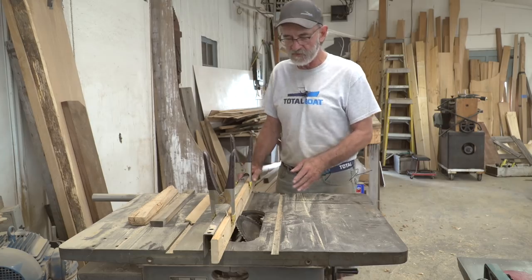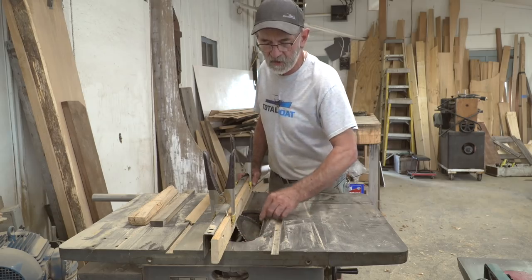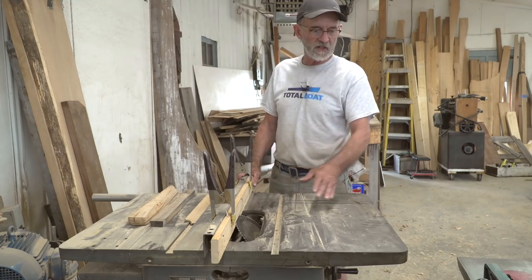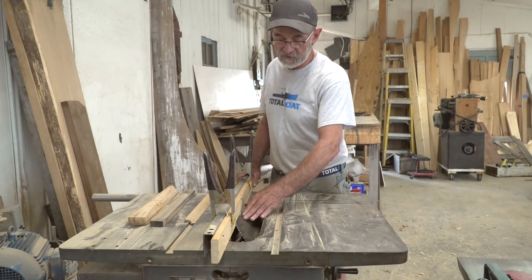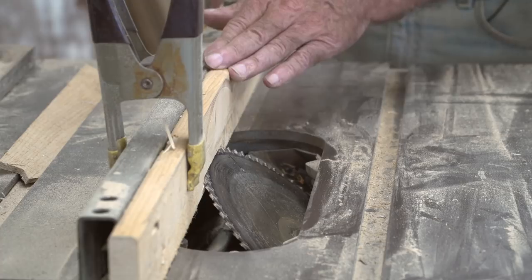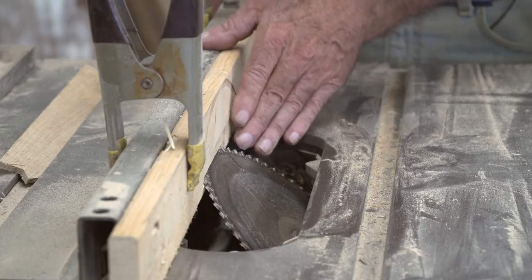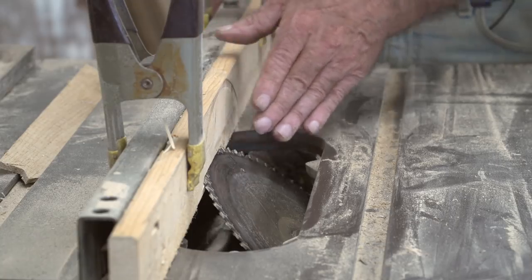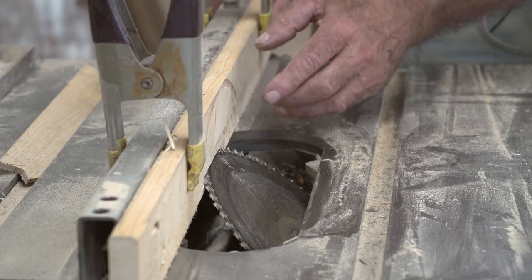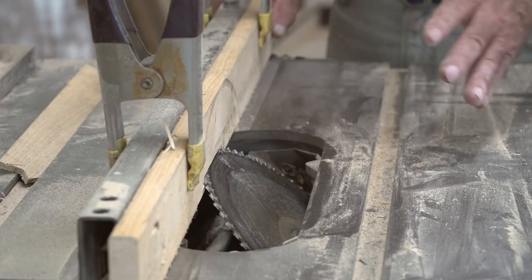I've set the table saw up with the blade on a 45-degree angle. I've even removed the guard from the top because there's no need for it and I'm afraid the teeth on the blade will cut into it. I've also added a piece of wood clamped to the fence with spring clamps. The reason is that to cut a clean 45 degrees off the bottom of the guard, I have to have the blade plunged up into the fence — I can't do that into the steel fence, so I added a piece of wood and cranked the blade up into it.